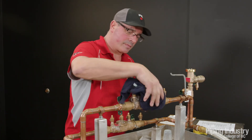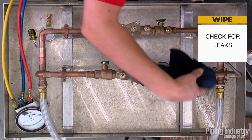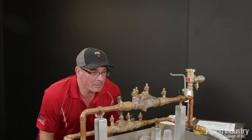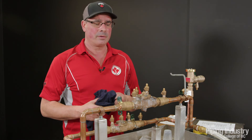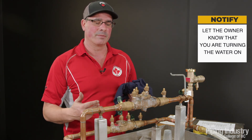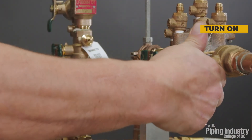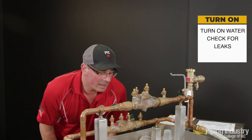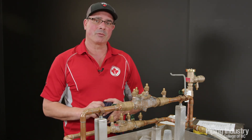Now we're just going to wipe everything down, make sure we have no leaks and no test cocks are dripping. Before you turn the water back on, it's always a good idea to contact the owner to make sure nobody has gone downstream and started working on the system while the water was shut down. Once we've verified that the system is tight and nobody has anything open, we can turn the water back on. One last time, check for leaks, make sure everything's good and the system's back in service. Hopefully this video helped — thank you very much for watching and we'll see you next time.